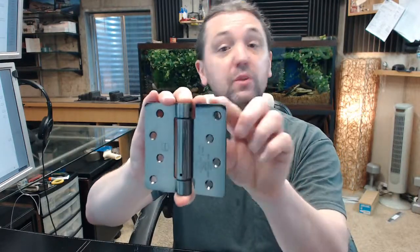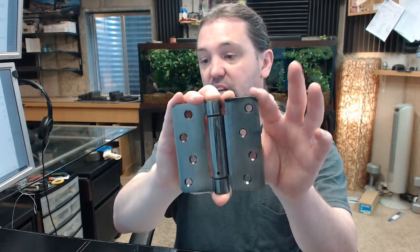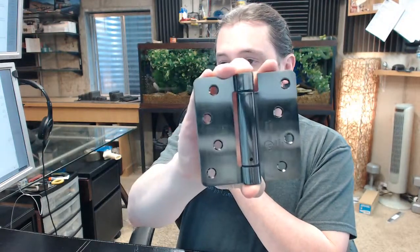Below the extended description we'll get into how many spring hinges you need per door, but first let's look at the document linked below this video called Template. The template allows you to review all of the different part numbers from Hager to know exactly what hinge you're looking at. This drawing covers 4 different hinges — the only difference between the 1750, 51, and 52 is the corner treatment. A 1752 is a 5/8 radius, a much wider radius than the 1751, which is quarter inch. 1750 of course being square.